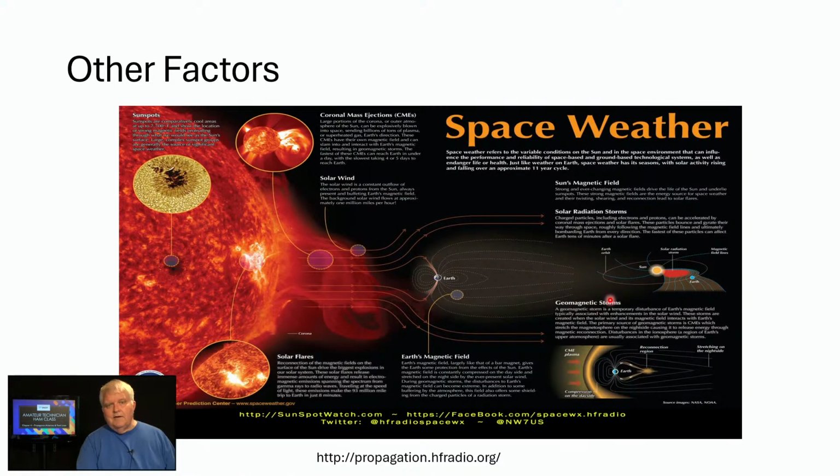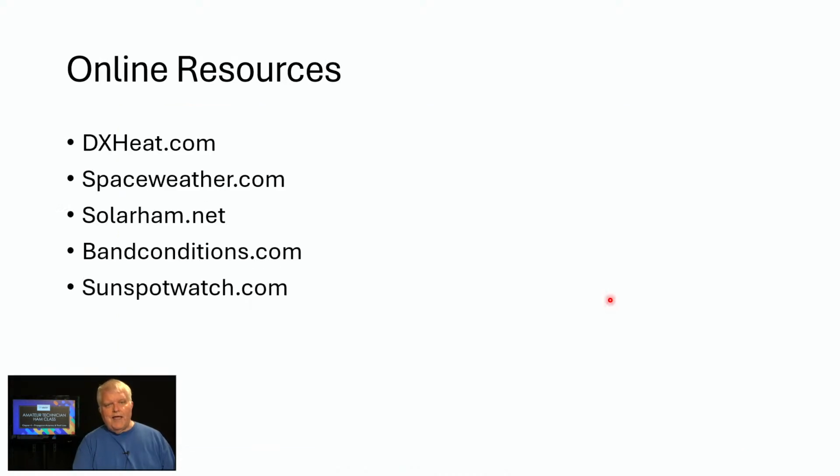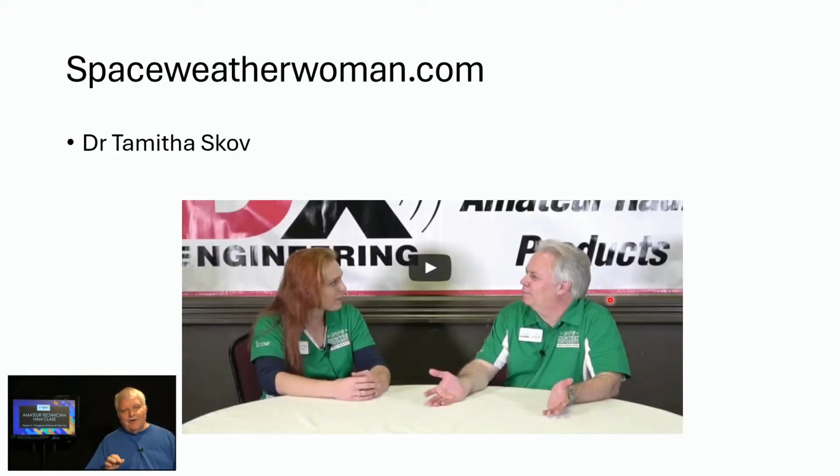So I mentioned the sun. Well, space weather in general can impact all sorts of things. And I heard also today on the air that there was a solar event that occurred during the day, and some of the bands were somewhat closed down today as I listened, because the sun can have a critical effect on high-frequency propagation. More information can be found at these online resources: DX Heat, Space Weather, Solar Ham. And did you know that we have our own solar weather person? Absolutely. Dr. Tamitha Skov does a weather forecast for the radio frequency bands.